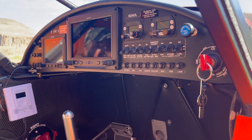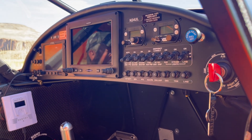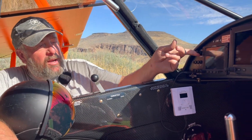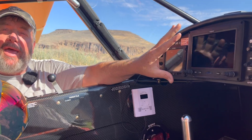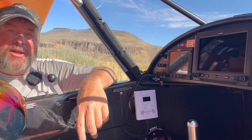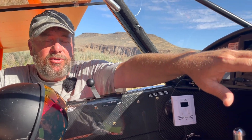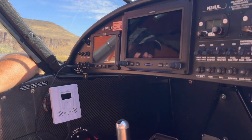This is a full-featured G3X system in a smaller form factor — it's a seven-inch screen, but it has all the same features as the regular G3X and all the same navigation features. The airplane has a full autopilot; servos go on right here, but we don't have an autopilot head because we can control that digitally through the G3X, and we can save that weight.